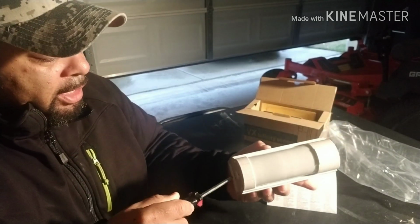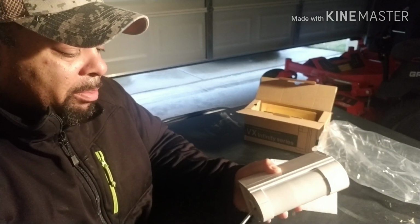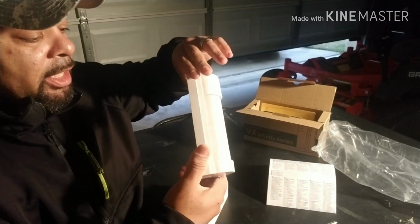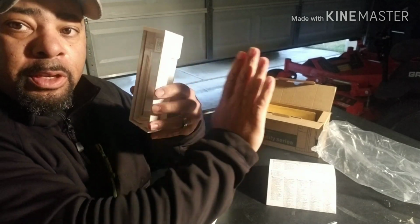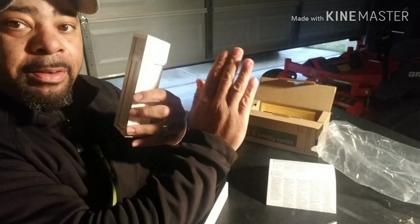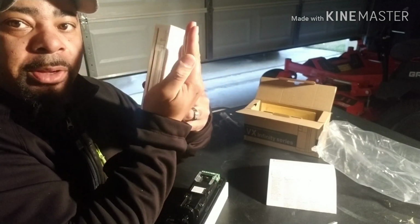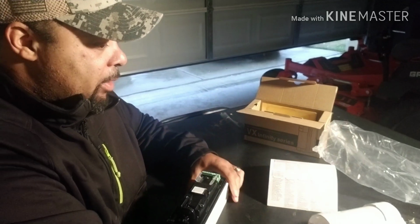All right. Once again, this is a wall mount unit. So it's designed for you to mount between 3 and 4 feet flat on the wall, to pick up anything that's going to be crossing that area is what you want to look at. So let's open it up here. Put the screw out. Slide that up. And that's the lens. So when I talk about the masking sheets that they give you, this is where they go. Depending on if you want to bring that detection range back for the PIR, you put those masking sheets in here. And then if you want to mask off an area that you don't want it to cover, you put those sheets, there's like little thin strips, and you put them in here. There's like little grooves in the plastic lens, and you just mask it off, and then it'll block it from seeing that area. So you don't have to worry about it. If you want to only cover 90 degrees this way instead of 180. All right, so that's how that works.